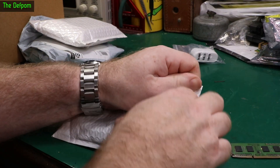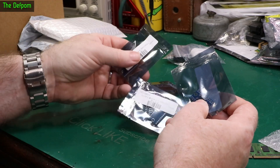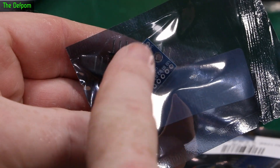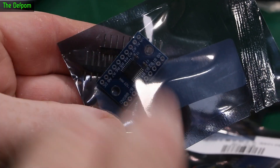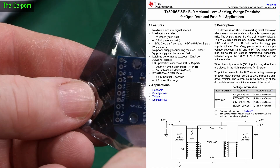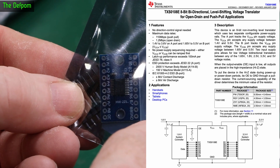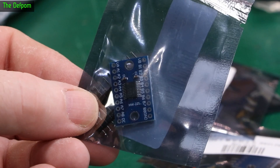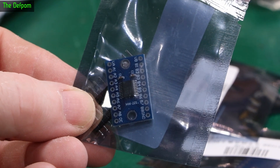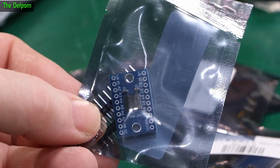I'll be going smallest to largest as always. These are level shifters. I'm not going to get one out, I'm just going to show you in the packet. Converts high level to low level across the IC — you've got an input on one side, output the other, or vice versa. I think they're bi-directional. It's got a TXS-0108E, 3.3V and 5V. There'll be links. I actually wanted these for a project I was working on recently. The project is now gone because I needed it urgently. I'll use these in future. I had some level shifters but they weren't the right ones — they were UARTs, so they're only unidirectional. I needed to do I2C, which is bi-directional, so this is one of the things I found.